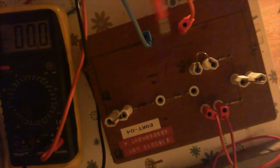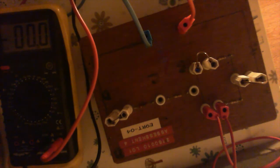Looking at this circuit, we have the supply — 21.3 volts from that charger. What we've got here is a path that splits into a parallel circuit, recombines, with one resistor in each branch, then recombines into a series circuit up to the last point. So I'm expecting when I check the voltage from here to here, it should be the full 20 volts — and there we go, that's right.